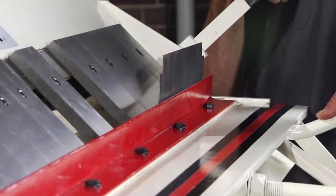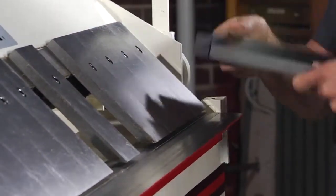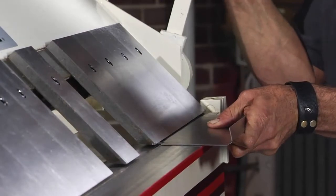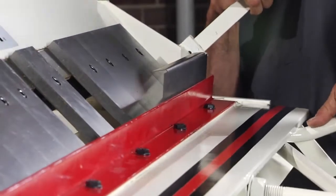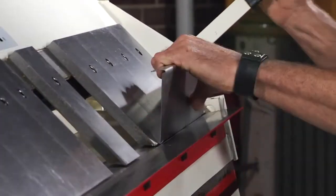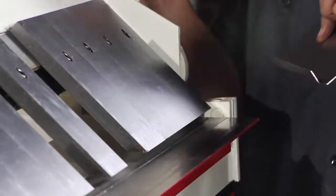Now this will go to 135 degrees, but I'm only going to go to 90. Get the opposite side — I want a little bit more than 90, but who's paying attention? This is for demo, right? And this will do 16 gauge steel, 48 inches across, which is what most sheet manufacturers from your supply house are going to give you. Let me go ahead and straighten up this side — pull it back a little from 90 to 90. There we go.